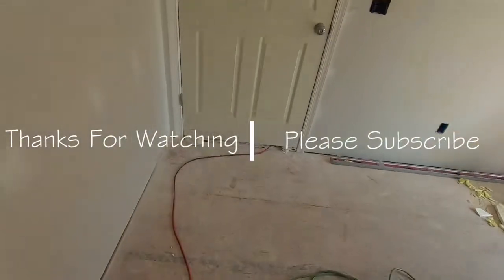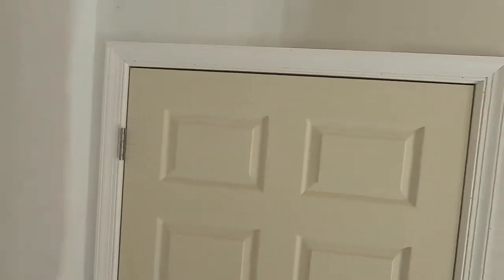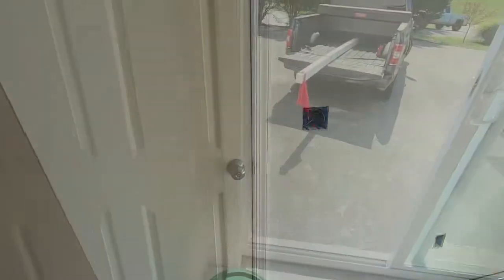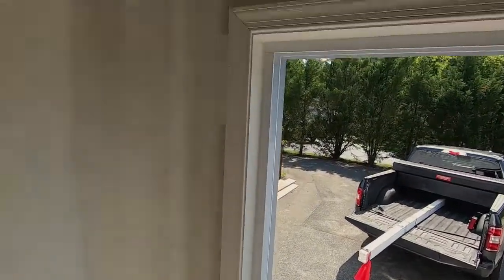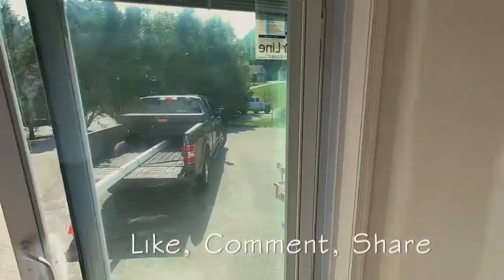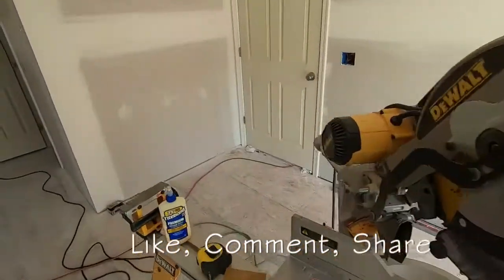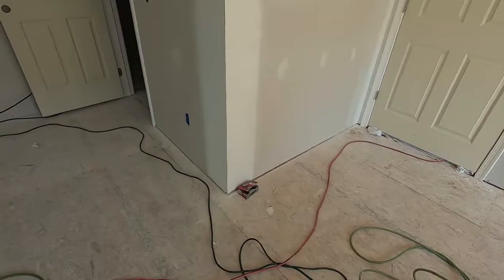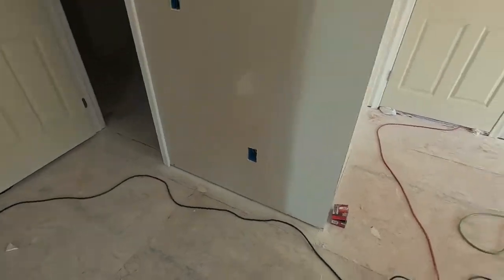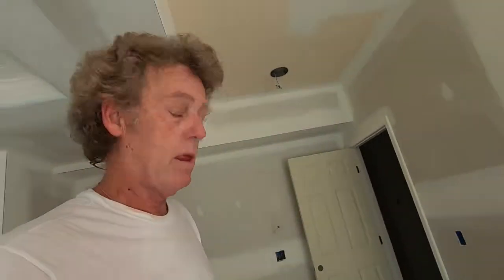All right, we've got the doors trimmed now and all the caulk work done. You see? Nice. Come back and putty these holes in the morning because the caulk will stay wet for a while. Don't want to mess it up. So I guess the next thing we're gonna do is I'm gonna clean this area here, set up, and show you what few tricks I know about putting up that baseboard. Ain't that many, but again, cope and saw and practice.